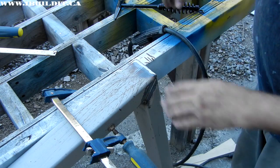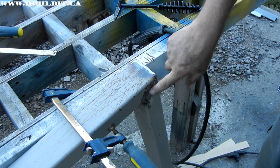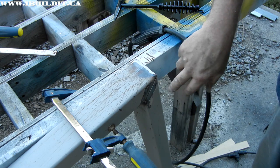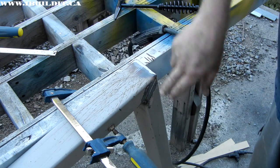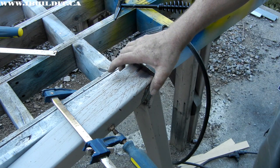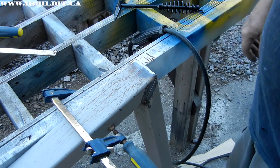So that's basically it — do the other three corners like that. I'll do a little bit of a weld in the middle, on the top and the bottom, on the miters, but that'll be about it. So the frame will be done.